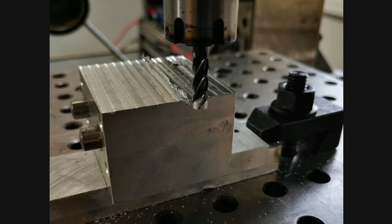It is interesting to note that the roughing end mill did not seem to need the lubrication to avoid loading. I guess it's the coating, but maybe it's the geometry of the cutter. What you see next is the 70 mil cutting depth.